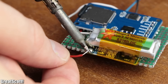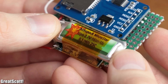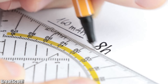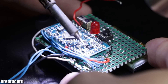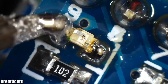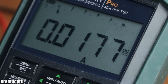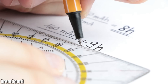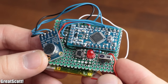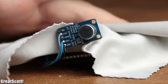What was still optimizable was the circuit's current draw of around 20 milliamps. With a battery capacity of 160 milliamp-hours, that would equal a run time of around 8 hours. To decrease the current demand slightly, I removed the voltage regulator and the two LEDs from the Arduino Pro Mini board, which resulted in a total current draw of 18 milliamps and thus a recording time of around 9 hours. And with that done, we have a small, long-lasting, and easy-to-use spy bug — which I advise you not to use for anything unethical.